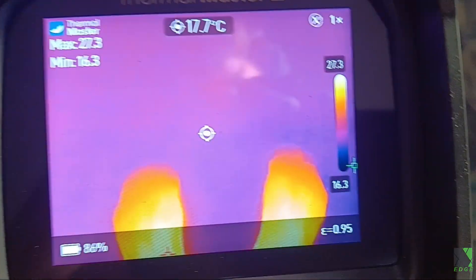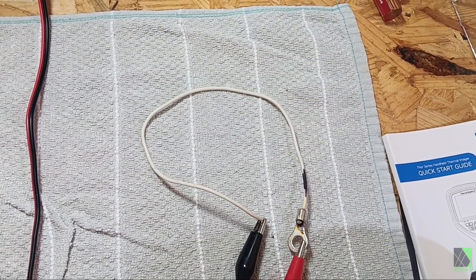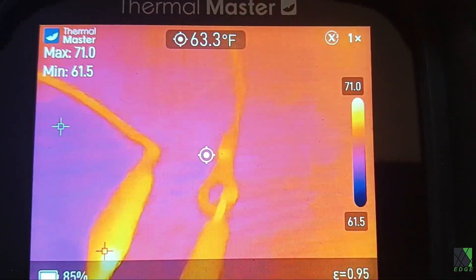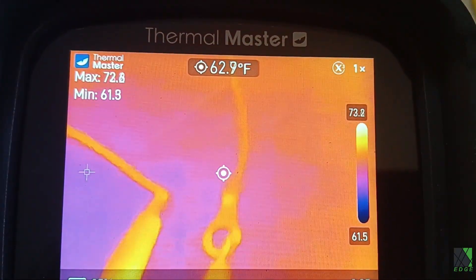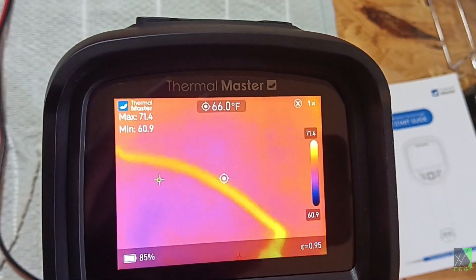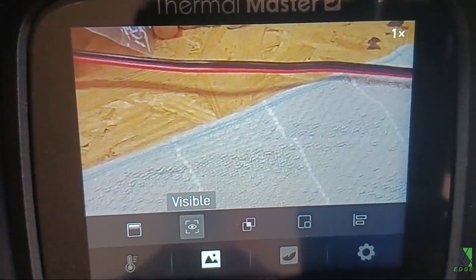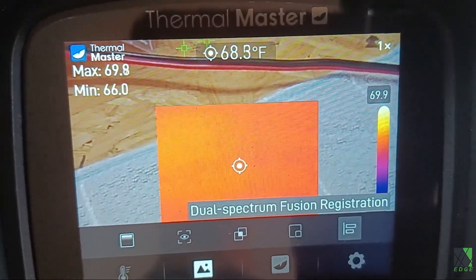This is a quick and easy test to verify the sensitivity of the thermal camera. One of my favorite uses is to see if a conductor, cable, or wire is getting too hot or has a bad connection. It's extremely obvious when you have a bad connection or high resistance — the wire will start to heat up and you can often spot problems before they cause a fire. In this benchtop experiment I shorted out my power supply through a piece of wire to test the camera's ability to scan it. The fusion modes are particularly useful — overlaying the IR camera on top of the visible camera makes it much easier to see what you're looking at, since IR cameras are typically lower resolution.